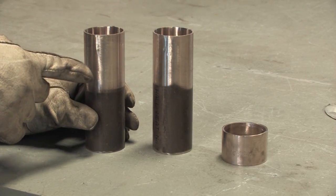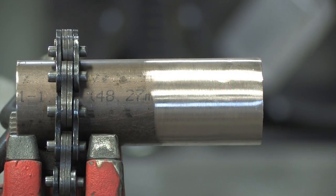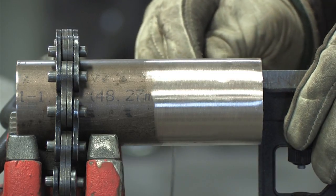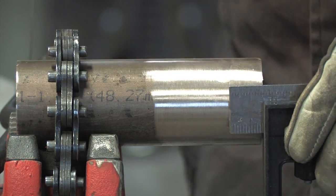depth on the outside. In order to get the insertion depth, measure the length of the weld band and divide it by 2. The square is set on a measurement exactly half the length of the weld band. Pipe half inch and below are required to have 2 insertion marks. Pipe 3/4 and above require 4 evenly spaced.